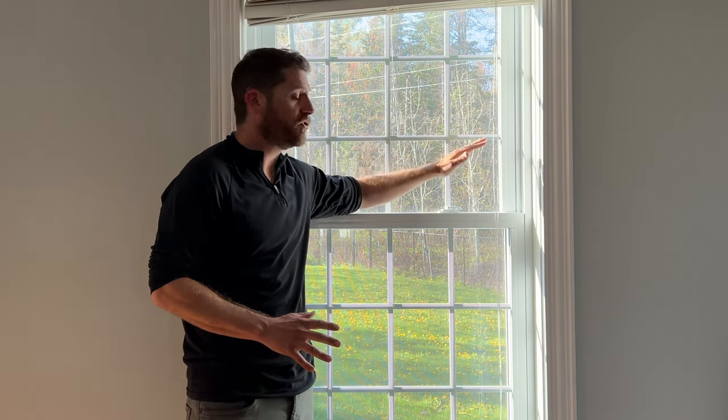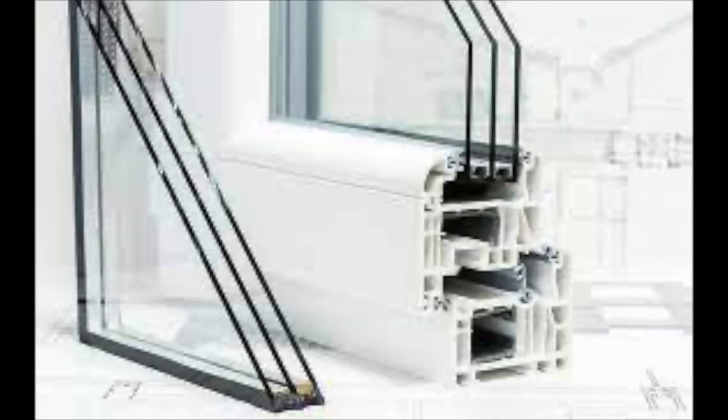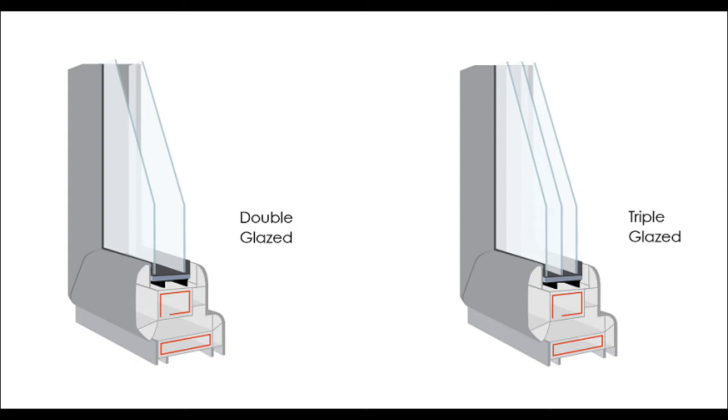Now it's time to rip that window out — if you can, if you don't live in an apartment and don't mind spending money changing the window. If you just have a single pane window, a lot of noise is coming right through it, so go ahead and buy a double or triple pane window. What that means is instead of just one panel, it has two or three panels with a certain type of inert gas in between that helps reduce noise coming in. It also helps with climate control and heat loss. They are more expensive than a single pane window, but changing from single to double or triple pane will make a drastic difference.